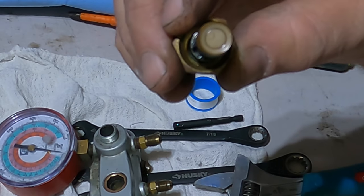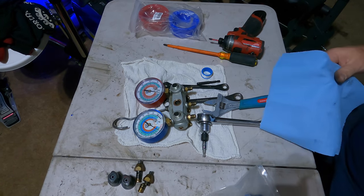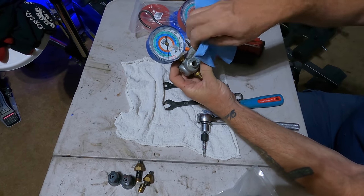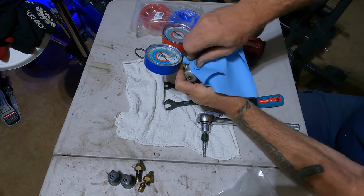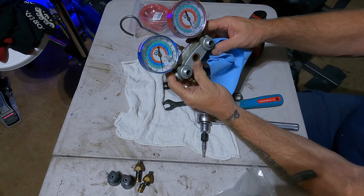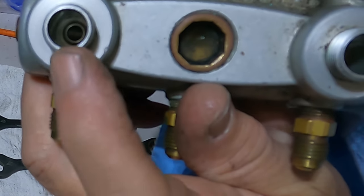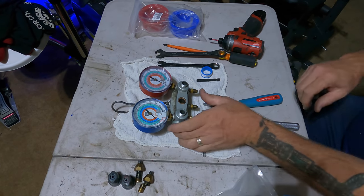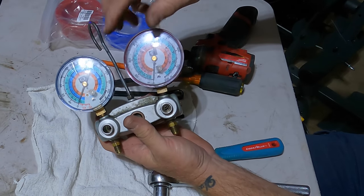That Teflon on that valve seat is totally worn out. Down inside there you'll see it's super dirty. I'm going to start cleaning those up, and then down inside is actually a valve seat — I might grab some Q-tips for cleaning as we dig into this. There are a couple of valve seats down in there. Let's go ahead and see if we get the gauges off. Always try and get your wrench on the nut that's on the gauge — if you twist up here, you'll break the gauges.